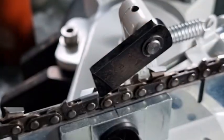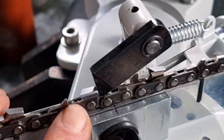If you zoom in on the semi chisel you've got that beautiful rounded corner on there. The same settings apply — it just doesn't matter whether you use semi chisel or full chisel, it's the same settings for both. The difference between semi chisel and full chisel is approximately around 10 percent in cutting performance, give or take a percent. This is a brand new Stihl RS chain, and that's the profile with that nice sharp point.